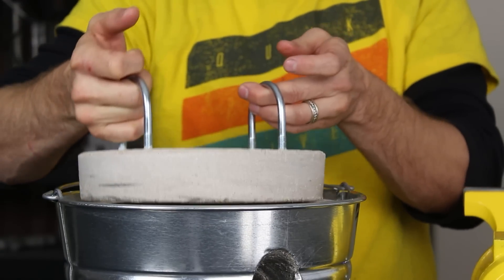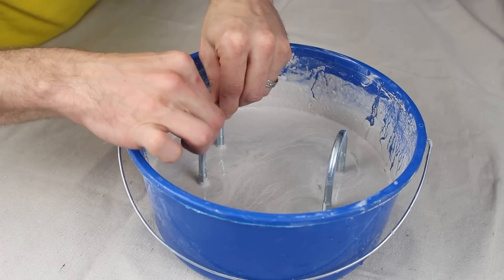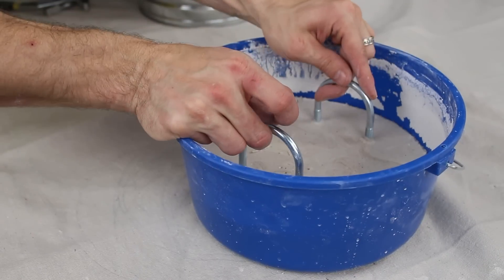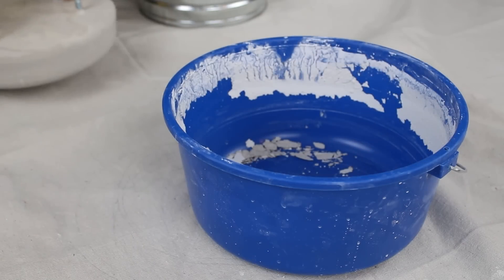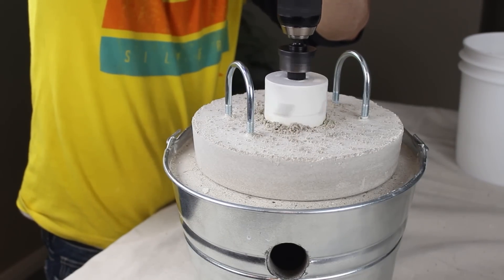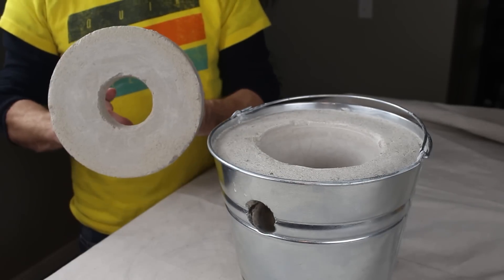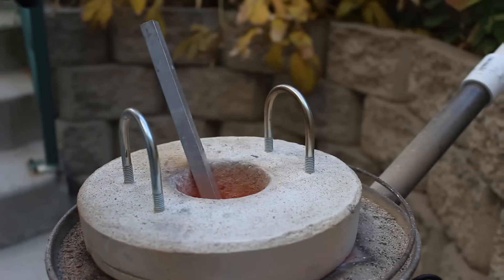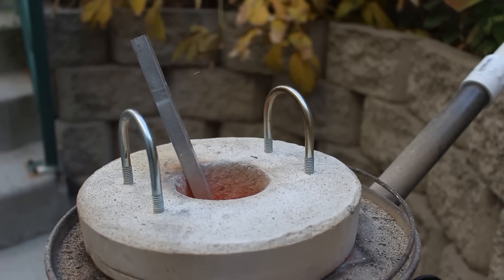Let's go one step further and make a lid to help retain the heat. I got a couple of 4-inch U-bolts from the hardware store and stood them upright in a 5-quart big mouth bucket filled with a half measure of our insulating mix. After an hour the plaster is set, and the whole thing pops free from the bucket, giving us a nice little custom lid for the foundry. It still needs a vent hole for relieving pressure buildup — you could form one when casting it, or drill one with a 3-inch hole cutting saw. With the hole in the center, we end up with a nice thick lid that looks like a giant white donut, which works great for venting pressure and gives us the option to melt metal without even having to take the lid off the furnace.